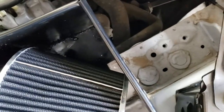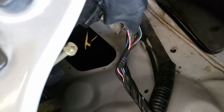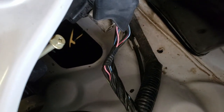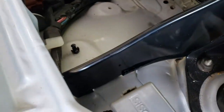As you can see, back down in there, you can still see the bottom panel we made, the filler panel. And you look over here, there's the fuse panel we were talking about this morning, earlier in the video. You can see it's still on the inside of the air box, still in the airflow. You can see right here on the camera, that is the factory air hole right there. So when the hood's closed, the air will still come in through the factory passageway and go more directly toward the air filter, and it won't be getting all the under hood air. So yeah, that's our custom made air box that you guys been watching us build literally all day.